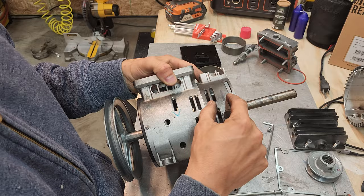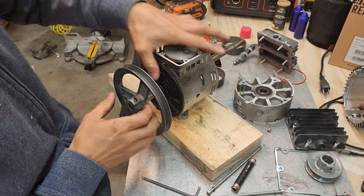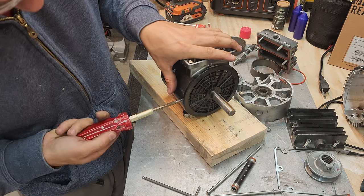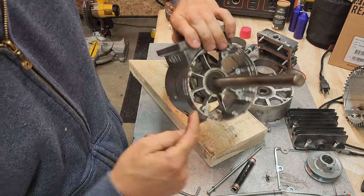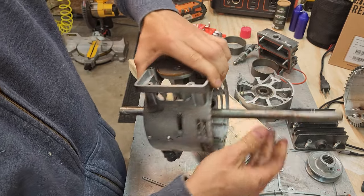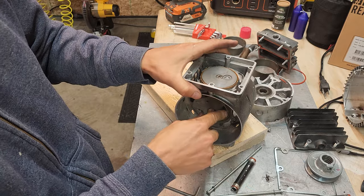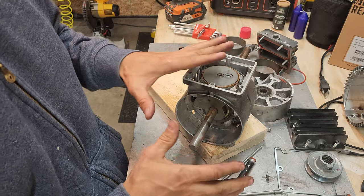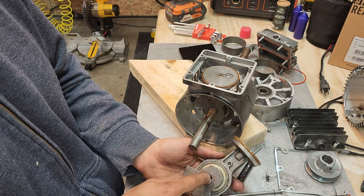Optionally I could slide this to the end. I'm going to pull this pulley and see what that looks like. There's a bearing here and the shaft can just slide back and forth — no worries there. This has one of these guys screwed in to lock it into place, so the shaft is staying put because of that. So I can cut this shaft, move it left and right — and that's what's working. The only thing we had to do was drill this hole to the size of the new shaft because this hole was originally smaller. Everything's together.